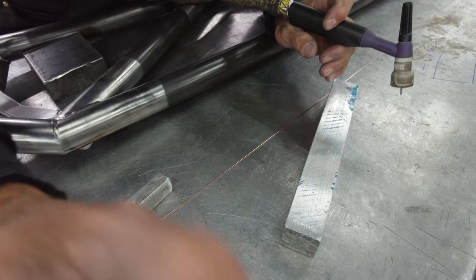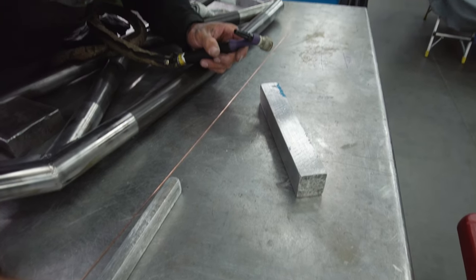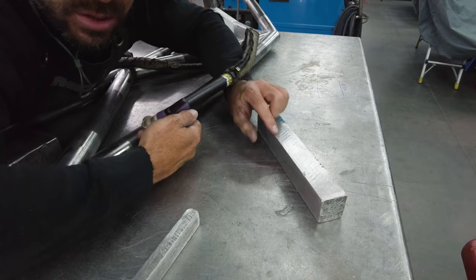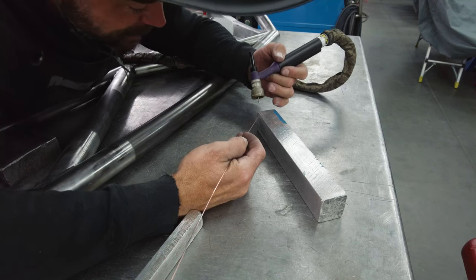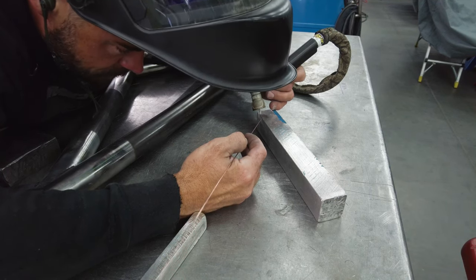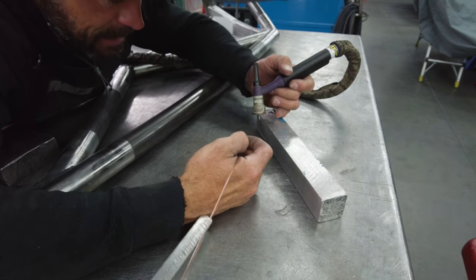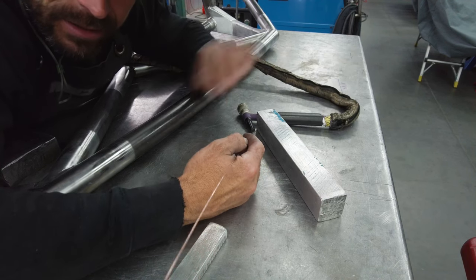when welding areas like this, if I can get a point where, you can kind of see how I'm looking at this thing. If there's a way where I can weld, and say I'm welding this corner where I can weld, I'm really uncomfortable because I'm leaning over the whole table and the bumper, but if I can, where I can see not just the front, but I can also see the tail of the weld after the cup, then I can kind of be in check with my consistency. You know, because every time there's input of the rod is really where you get that overlap.